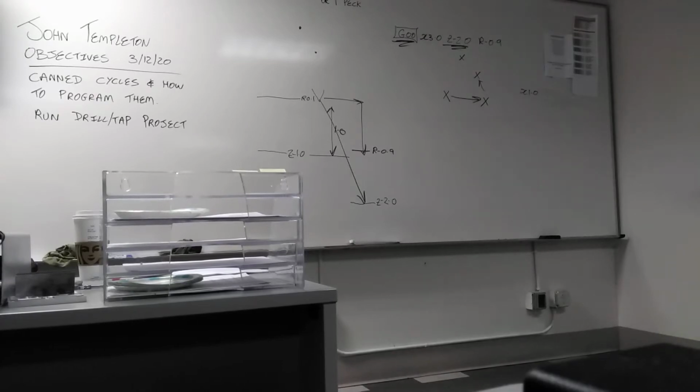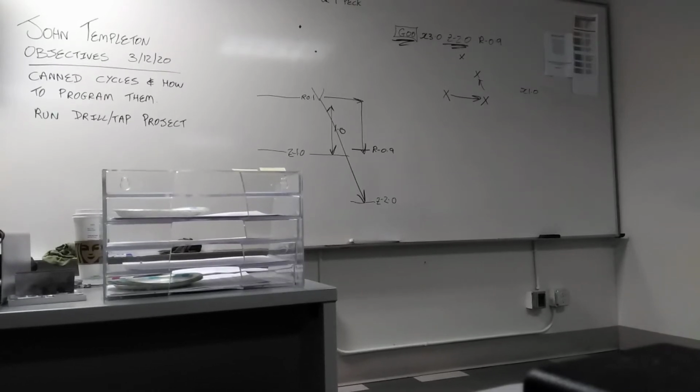So like when we were doing the clamps, even when it drilled the hole before we tapped it, it was kind of going like that, right? The G83 cycle. Peck drilling, right? So it's peck drilling. So on this one, for a 2-inch, you'd peck drill it versus. We're going to talk about that in a minute.